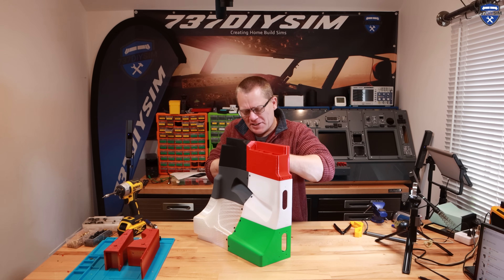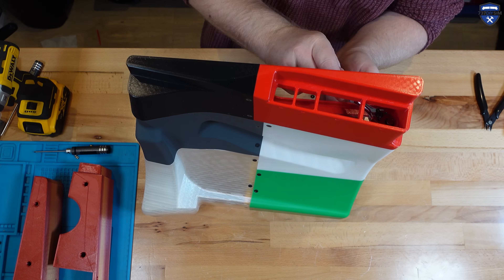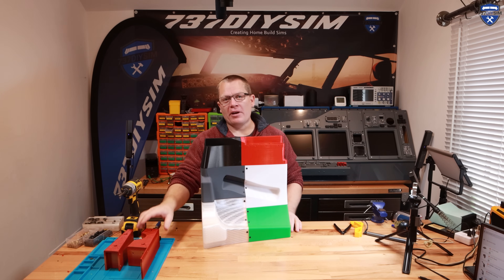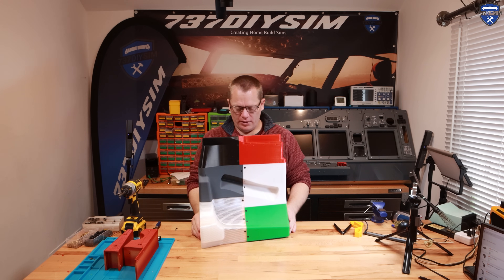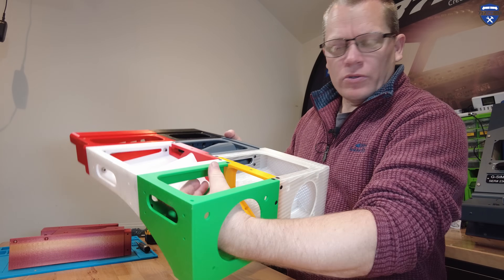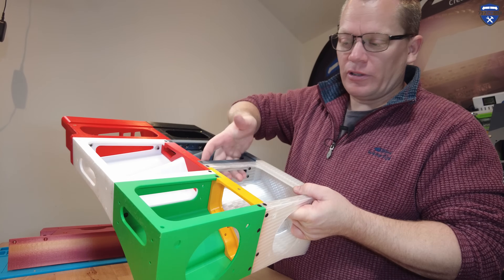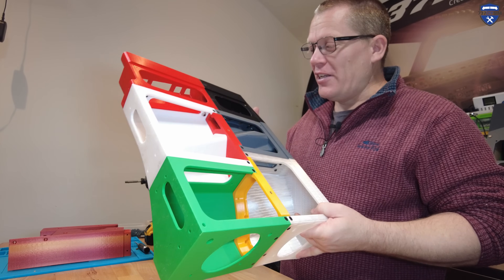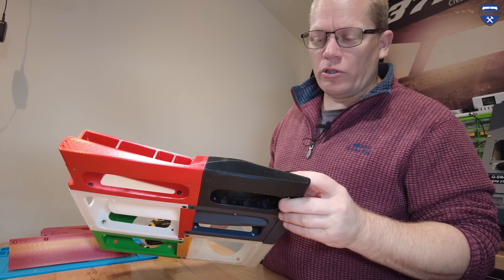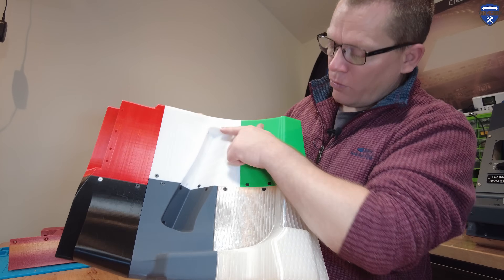Even with all these studio lights, seeing black screws in a black body is really hard — you've got no chance of seeing it on camera. That's it — almost at full height. We've got the base adapters to go on here and they just help secure it to the MIP panel behind. You can see we've got loads of lightning holes all the way through so regardless of what cables we use we can route through in every direction. I also intend to fit a panel at the front here if we can get it in. Underneath we can fit our LED strip, with wire access holes at either end.